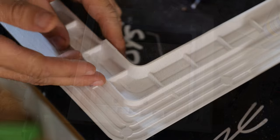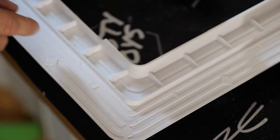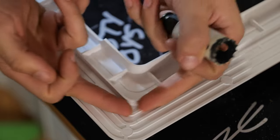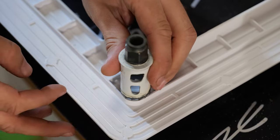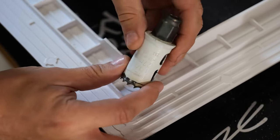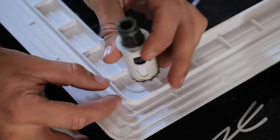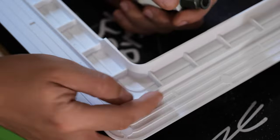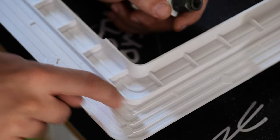Having watched videos of people getting leaks in these fans, most leaks come from the corners. Instead of cutting a 90-degree corner, I used a hole saw to match the external radius — looks to be about a 25mm radius, and I used a 27mm bit to get close. I'll then file into the corner to finish it off, ensuring the metal sits as snug as possible against that corner, since that seems to be the point of failure for a lot of people.